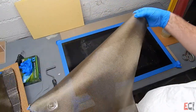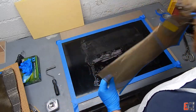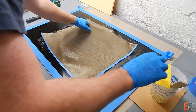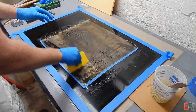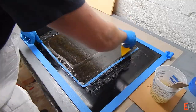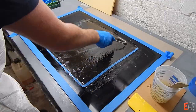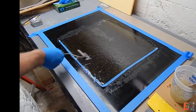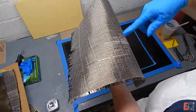Here's the 200 gram basalt — it's nice, fine stuff. Like I showed earlier compared to the Kevlar, there's not really much there. You'd look at it and think it was 150 gram carbon, just because it's much denser and it takes less basalt to make that same weight. I'm doing a lot of rolling here trying to get the surface nice. Because of the air in the epoxy and doing a wet layup like this, I'll probably have some surface defects, but here goes the second ply.